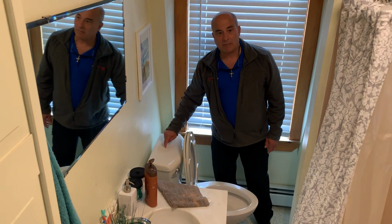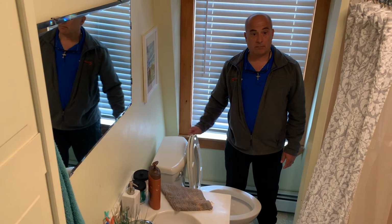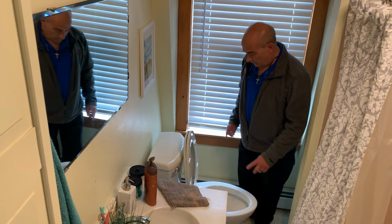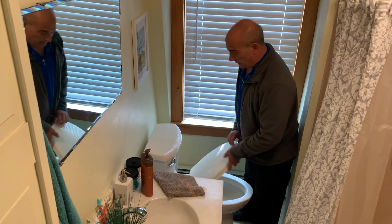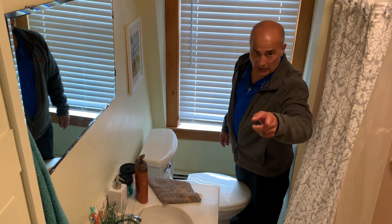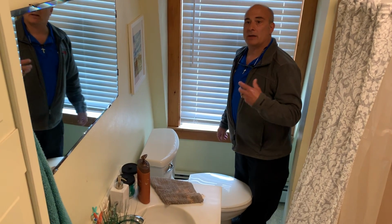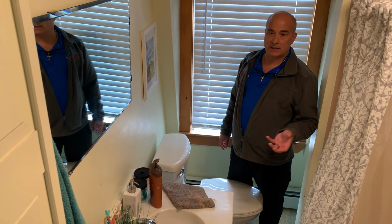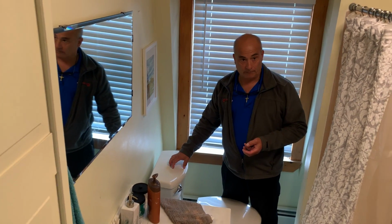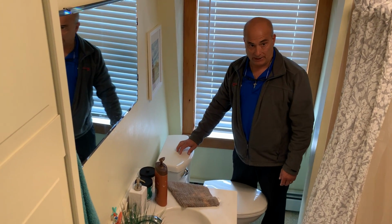It means that the water from here is slipping by into your toilet and costing you money on your water bill. Does that make you happy? No. So that tells you that. Now, people don't know, you said it a lot, flapper. Andrew knows because he's been around, but a lot of people don't know what you're talking about. So you may want to dumb the words down a little bit and say, the seal that keeps the water in the tank is starting to go on you. They get jelly-like, they get destroyed, and it probably needs to be replaced.